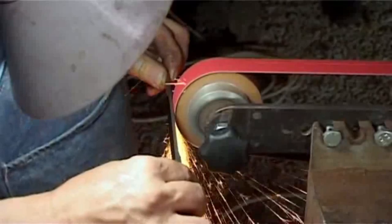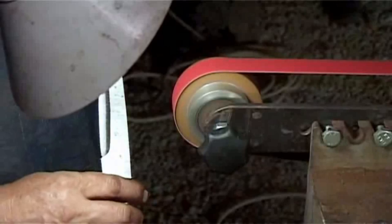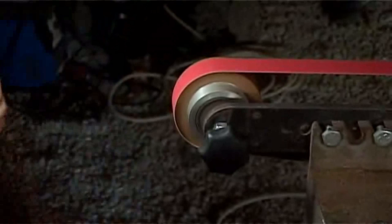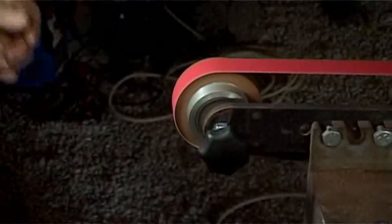All right, so can you see how once I start establishing a hollow, the wheel will constantly fall into, sorry, the light's in your way, the wheel will constantly fall into that position. And as you start getting the groove deeper and deeper, it actually becomes easier and easier. Grinding daggers with small diameter wheels gives you a very deep grind with a very crisp, prominent center ridge. It just reflects light and makes it look great. And it's adjustable.